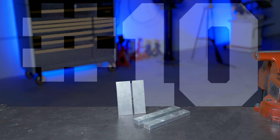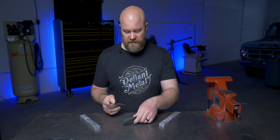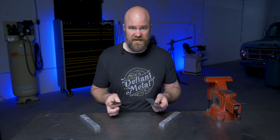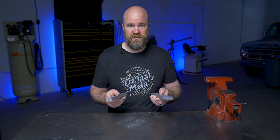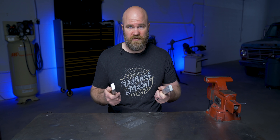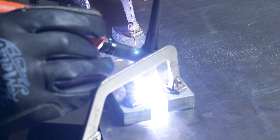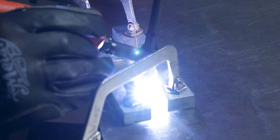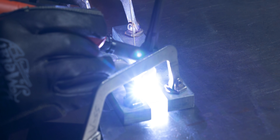Number ten: using a heat bar. This can be important when welding anything thin where you don't want heat to travel or warp the material — especially thin stainless steel. You can use heat bars made out of a couple of heavy pieces of metal, aluminum in this case. Clamp them down as close as possible to where you're going to weld, and they'll help absorb the heat from traveling out while keeping the piece nice and flat.